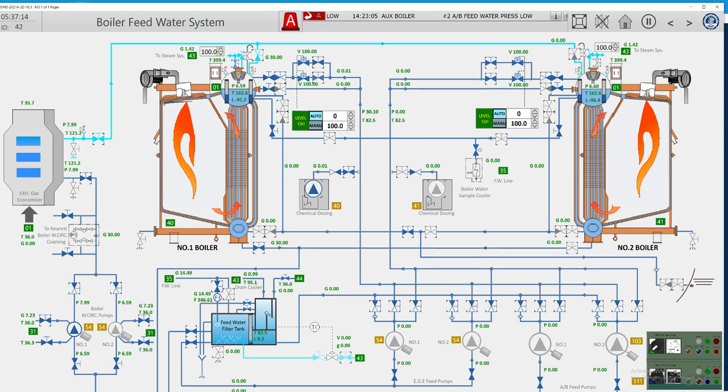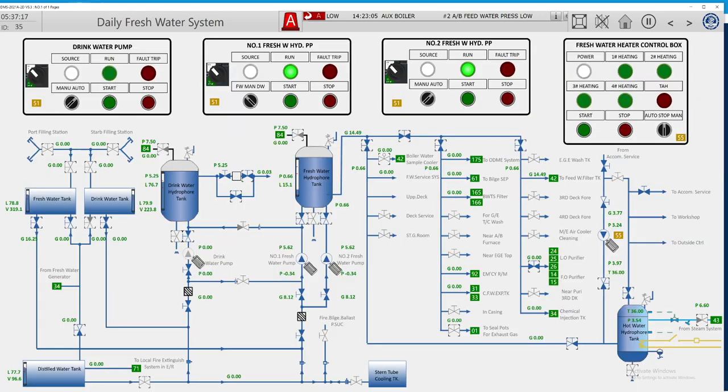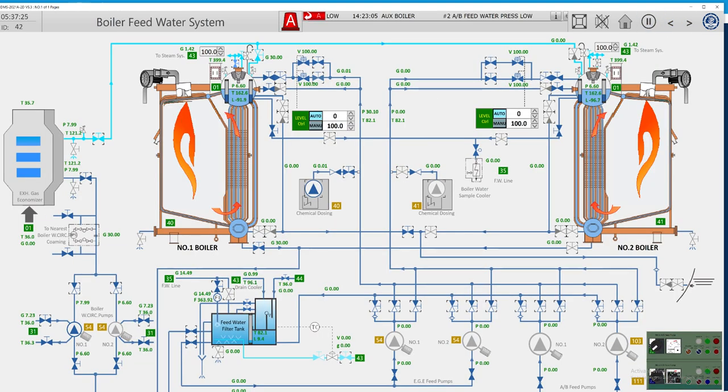With one valve it's okay; I'll leave the automatic filling. Another important thing: we have normal evaporation from our feed filter tank every day. There is a vent on the aft of the vessel, and we keep our filter tank at about 80 to 90 degrees, so there is also evaporation produced through time — natural losses from there.